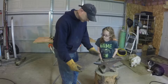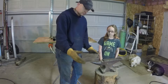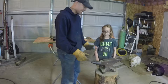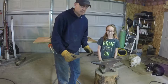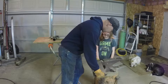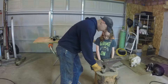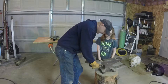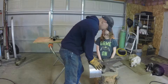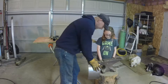We've got our piece of sheet metal — it's the size we need to make the right diameter cylinder. We had the math person inside figure that out — that would be mom. So we're going to use the horn of the anvil here to start making this bend because we don't have anything else to really bend it around. It's got to be about a five-inch diameter circle, I think.